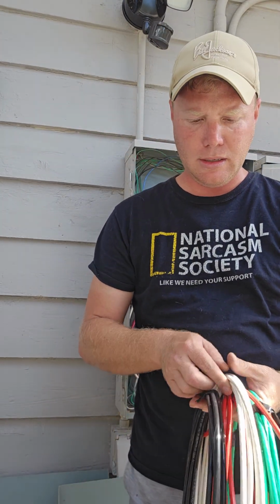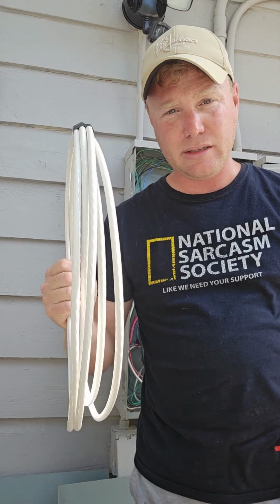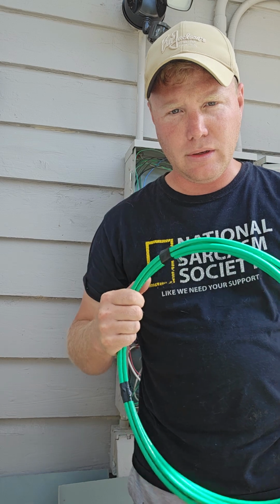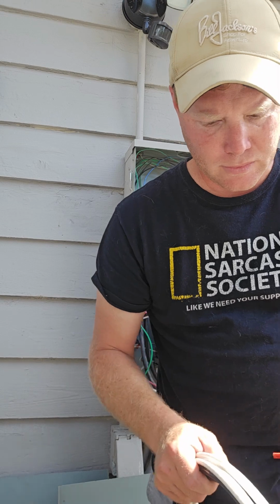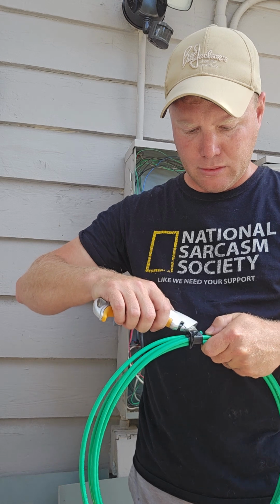Alright, so here's what we got. Black, that's going to be our hot. White, it's going to be our neutral. Red, hot. Green, ground. Can't mess this up. Well, I'm sure somebody could. Alright, so actually I'm going to start with the ground.